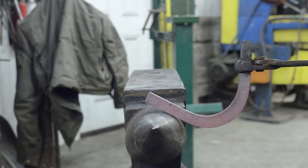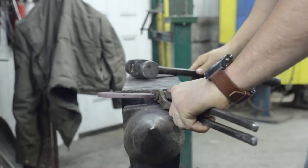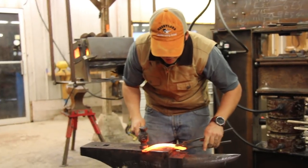When we're hitting the inside edge of a shoe, we want to make sure we bring it around past 90. Whatever angle you get it bent to at this point is the angle it wants to stay. You have to work hard to change it from this angle as you do your toe bend. You want to be consistent with what you do.